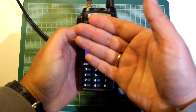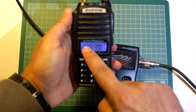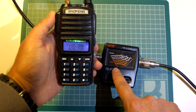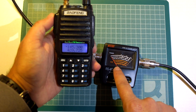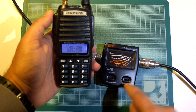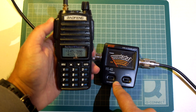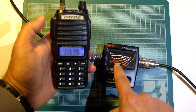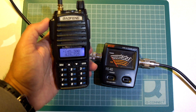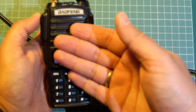It is on low. Let's begin with the low setting on 2 meters. First to check SWR — the needle barely moves, that's good. Now let's switch to power. 2 meters, low setting. It's a bit more than 1W here — if you see the needle, a bit more than 1W.